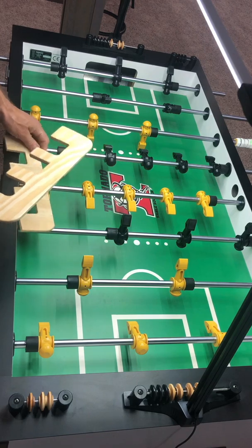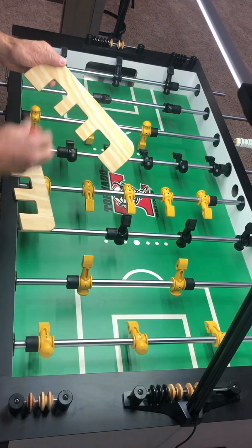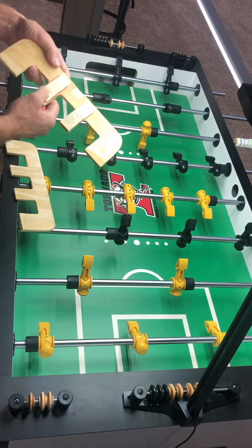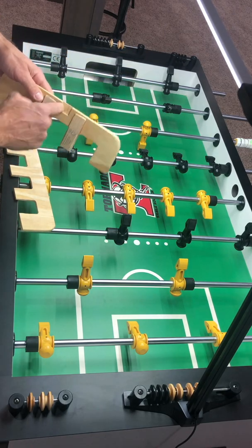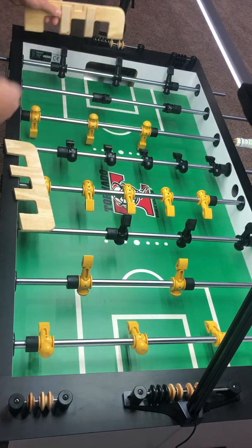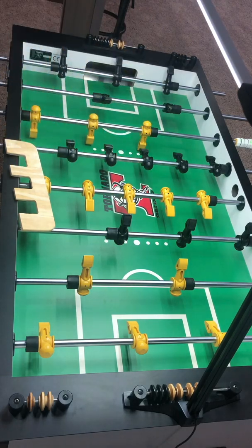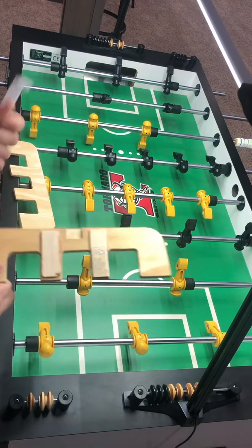So I went ahead and made a couple of my own. First one I made, I kind of screwed up because I had the wood grain this way and these tabs started to break really quickly, so I went ahead and reinforced them. Plus, since this one was kind of already jacked up, I played around with making a notch in there for the center guy to hold the board in place. Before, I had just made a little custom fit bracket to go over there, felt lined, of course, so you don't damage the table.